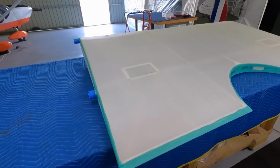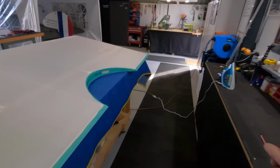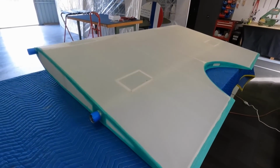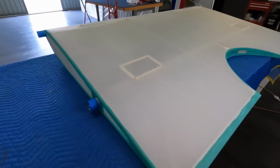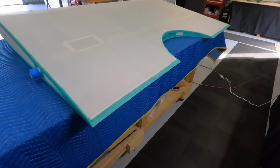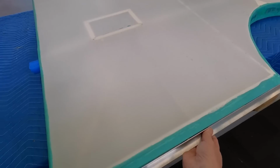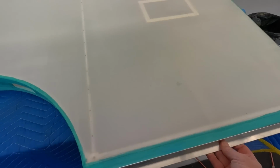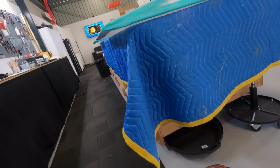All right. One more shrink on this side, so I'm doing 3 at 320. The iron fluctuates a bit, so 300 for an ultralight, 350 for a certified aircraft, so 320 seems okay. Just keeping an eye on, like my trailing edge, just to make sure it's not getting pulled out of shape too much this way, or like twisty ways.